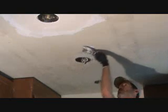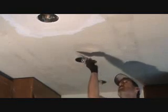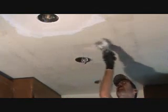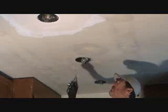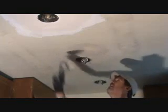And this is all-purpose joint compound I'm using. You see how the patch can now get a little bit bigger if I use that, and I can just go over the front there like that. And there you go. That's enough for just before we put our skip trowel on there. I'm going to wipe that.